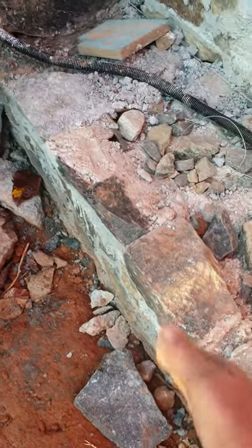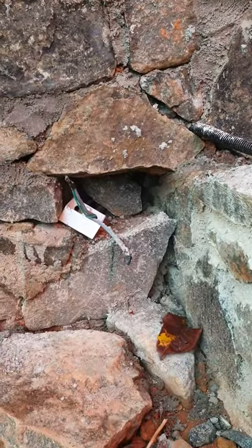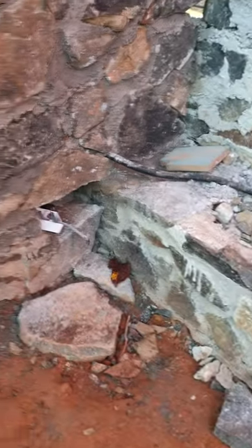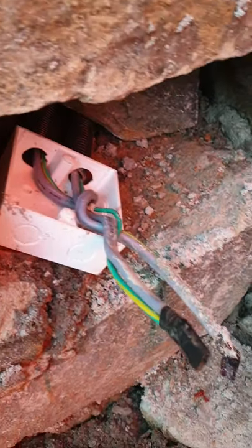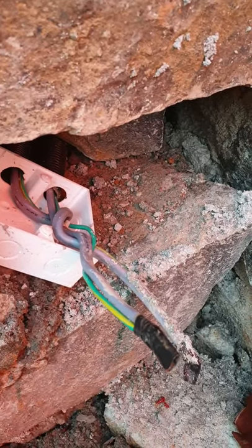And then we have a space to fill in between, and here also we still have to add a layer which allows us to put even these electric cables in the right place, and the plug points left and right of this surface of the sitting area. There's here already one plug point and there's another one. Now I was choosing a stronger wire. It wouldn't be really necessary if it was not me who decided about it, because I would just give it 2.5 cables. Now I put 3, the plus and the negative and the earth.